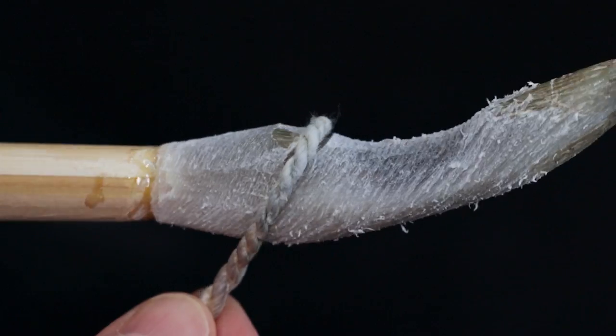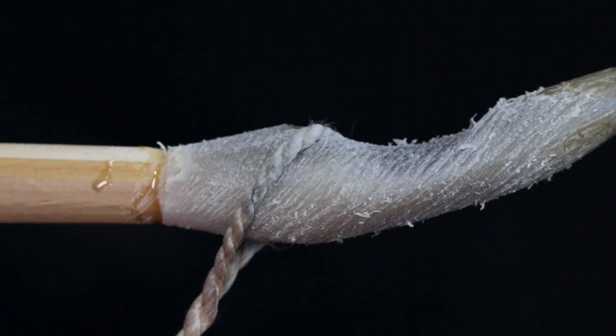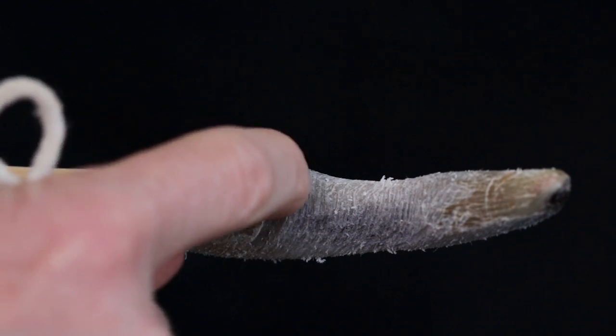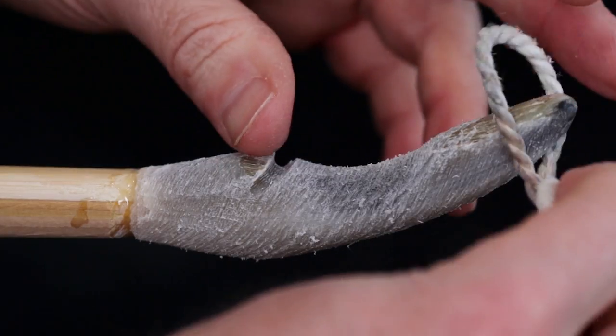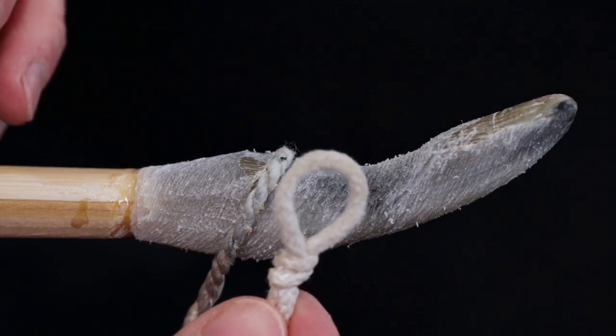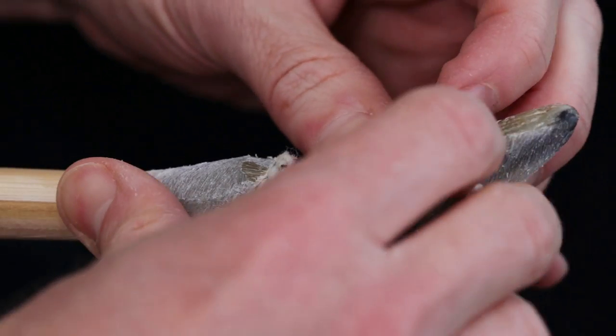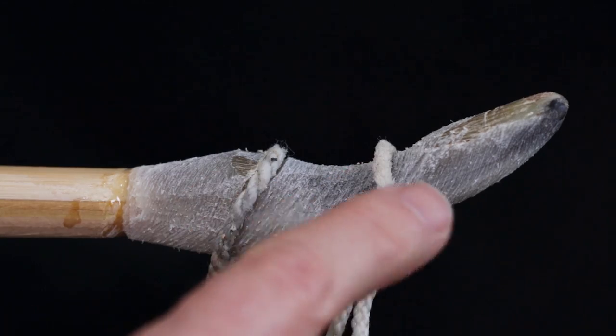The groove I have made will be enough to hold the bow braced so we can mark the string position. As you can see, our dipped shape will allow for easy bracing with a simple bracing cord without resorting to an unnecessary second groove. Tie the knot of the bracing cord correctly and it will sit against the bulbous part of the nock and won't slip down to displace the bowstring from its groove.